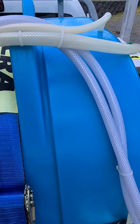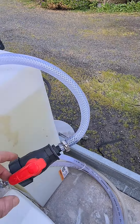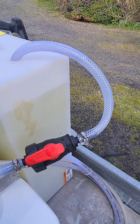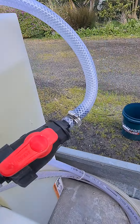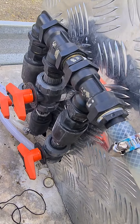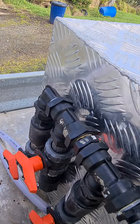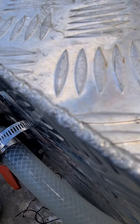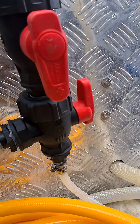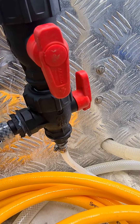On the soft wash side, out of your soap tank, we've got a three way valve — it's splitting off water or bleach, so you can flush those valves. Three eighths line going to a blend manifold. So we've got water, bleach, out of the blend manifold, runs around to another three way valve. The three eighths off the bottom is going to my downstream injector.